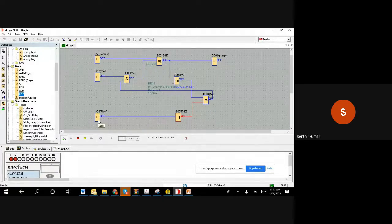Right. So people used to call this pump dry run protection, because it doesn't allow the motor to run dry without water, because that will destroy the pump by overheating and then spoiling the contact coils inside, and then it will get damaged. So this is to protect the motor. This is the logic of how it works.